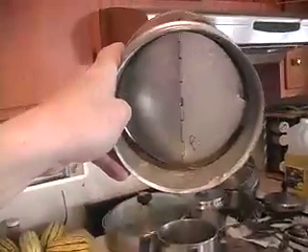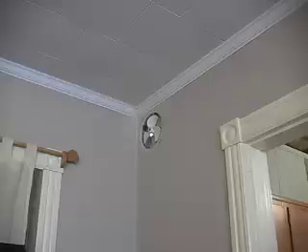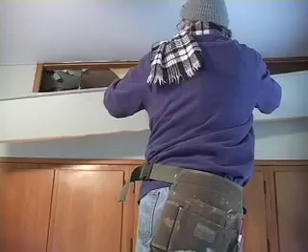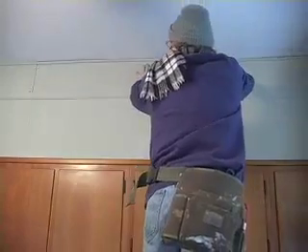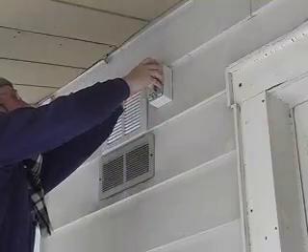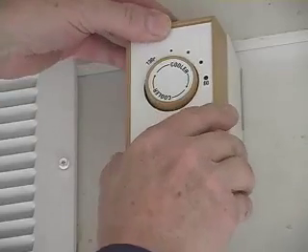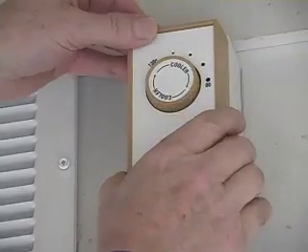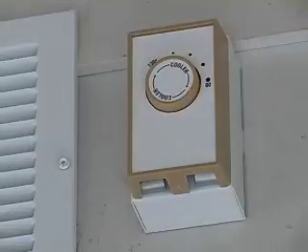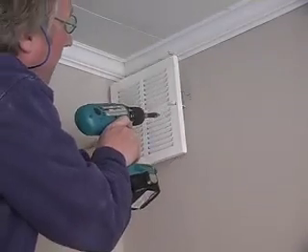There's a metal piece of ducting I'm going to put in this end so the fan can fit into it. See it up there on the wall? That fan will switch on and suck air through the duct which goes above my kitchen cabinets. There's the thermostat in the porch. That thermostat is the same one you use for a roof fan and I'll set it at 80 degrees, so when the porch reaches 80 it will switch on and suck air into the living room. It'll switch off at 70 when the porch cools down, and there's the fan sucking air through the duct from the porch into the living room.